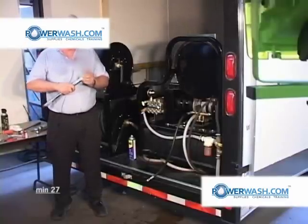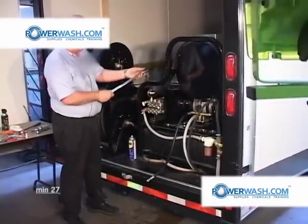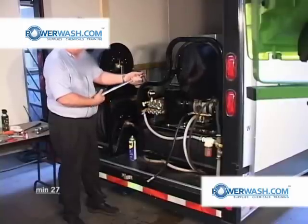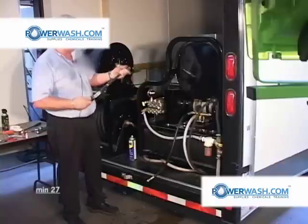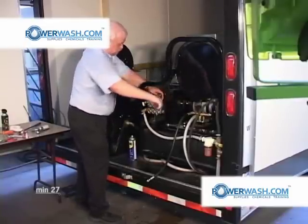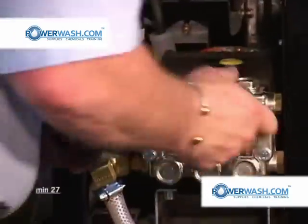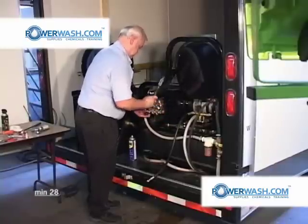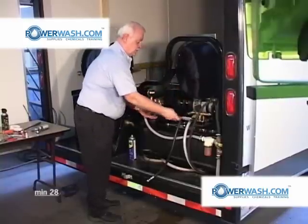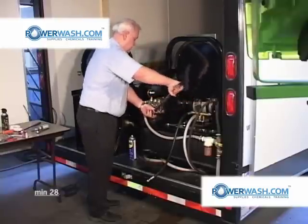Again, we're going to use a 30 millimeter socket, torque at 70 foot-pounds. Lock it down. We'll go back and tighten all of them. Lock it down. Continue in this fashion until you have them all torqued down. Now it's completed.